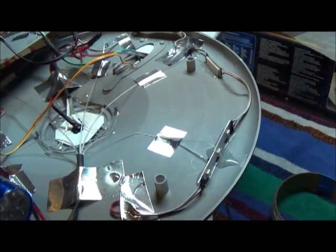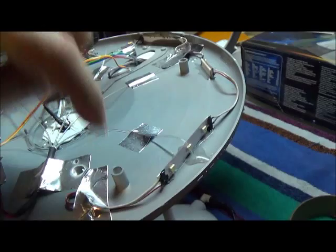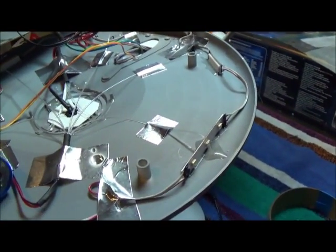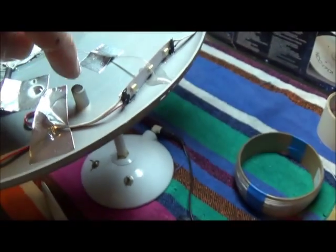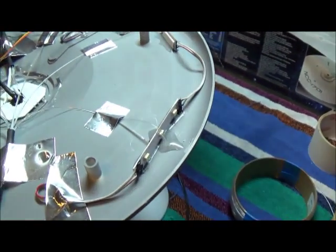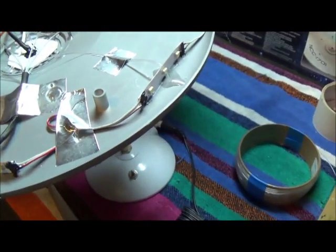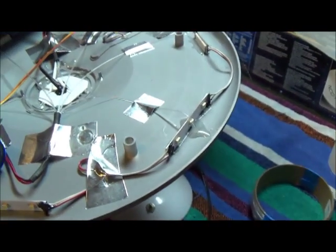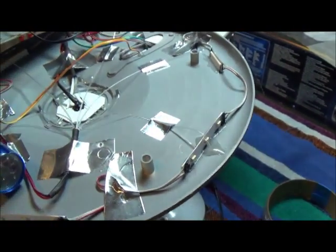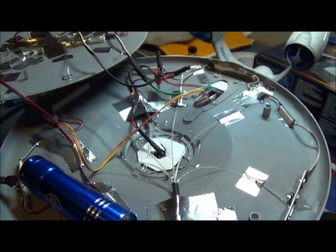And the thing about using an epoxy, it will allow these things to actually lubricate and slide in there a little bit better, and then they'll seal up. If you just put a glue in there, the glue might act a little bit too quickly and actually start melting the pins in the edge, and you won't get a real good chance to push those down. Because if it were one joint, that's fine. That's a snap. You put that down and you're done. But when you've got essentially 5 joints that you want to make up real quickly and they're not right next to each other, then you want a slower moving glue that will allow you to do more positioning before it starts to set up. But that's the next step.